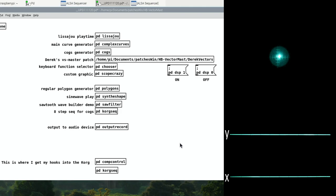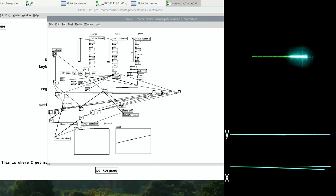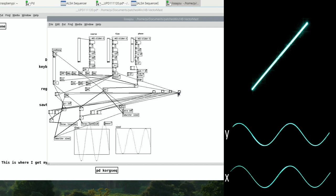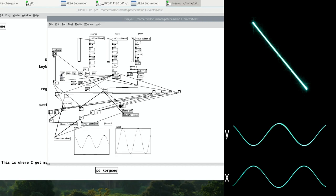Essentially a complex stereo oscillator, divided into separate modules, it's based on the principle of quadrature, and works like this. If you send a sine wave to the vertical input of an oscilloscope, and send another separate sine wave at the same frequency but 90 degrees out of phase, a cosine wave, to the horizontal input, together, they'll draw a circle. When they're forced to the same phase, they reinforce each other to graph a positive going line. 180 degrees out of phase, they completely cancel each other out, and the graph goes the other way.